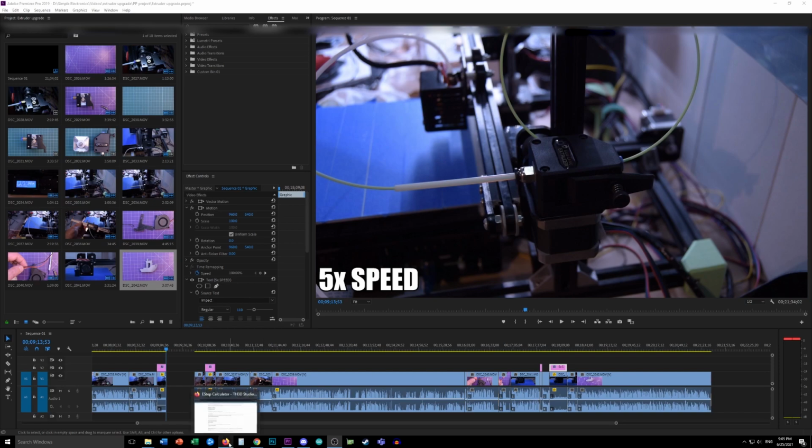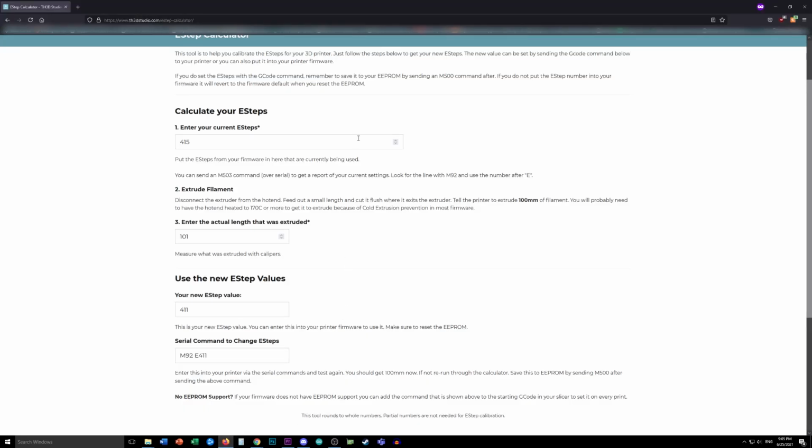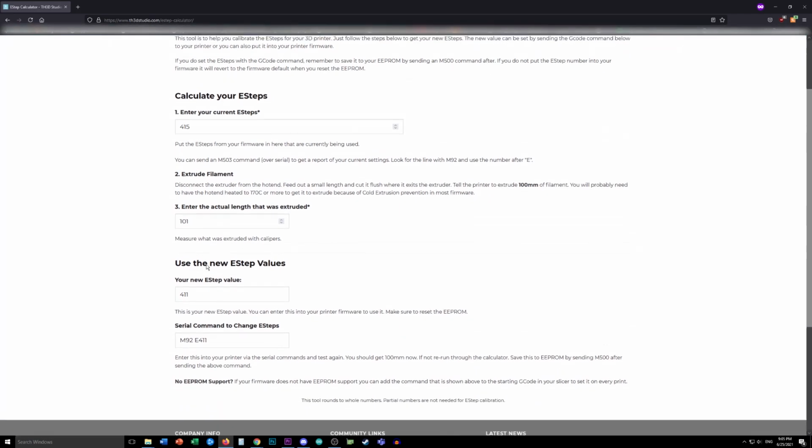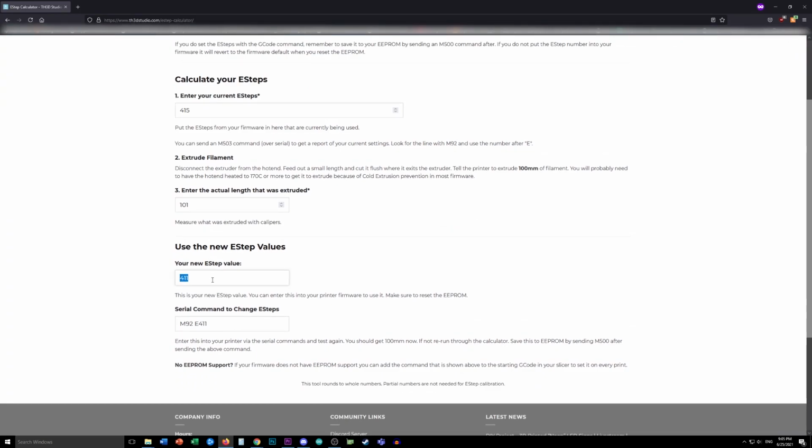So basically, what you do is you measure what came out, and you go to a website like this one here, linked in the description. You put the amount of E-steps that you set your printer to. You extrude 100 mils, like I was saying, and then you put the measurement, how many you've extruded, and it gives you the new E-step value.